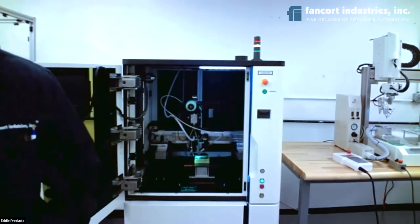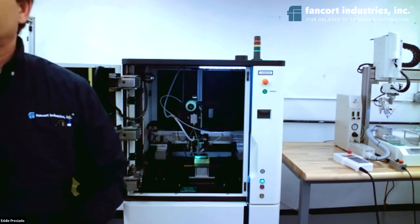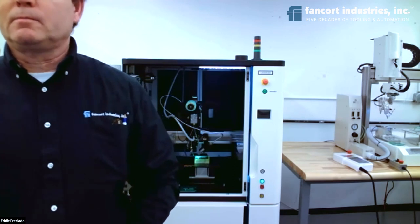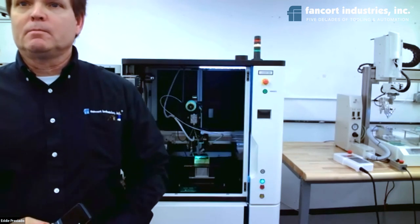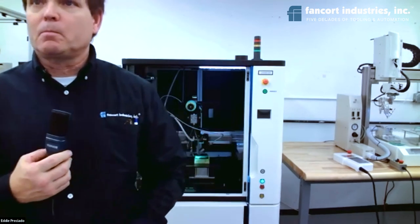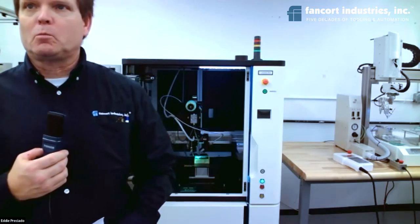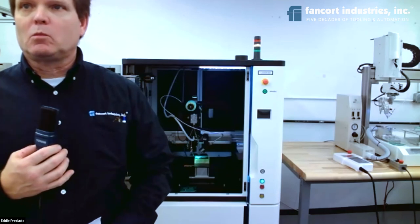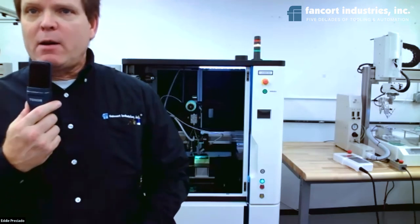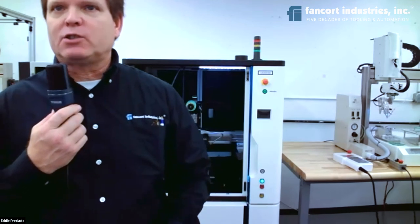Okay, thank you for the question. There is a range, and you can try with the spot itself. The largest area right now is around 60 mm square. That can be arranged by custom range. So we could go a little larger than that, or maybe even a bigger lens of 100 mm square, and we can still put a mask on it if you don't want reflow at some particular zone. And Ken, that would be related to the lens, okay. Yep, so it would be a lens change out or a lens design. Okay, yes. Thank you.